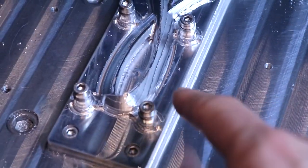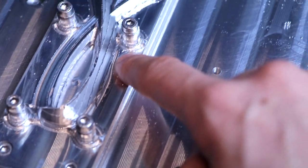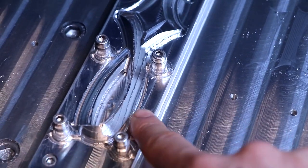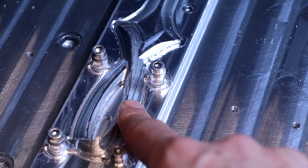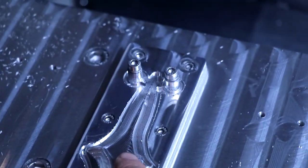The top side is more and more finished. I really think this tool is getting at an end. And also, it cut way deeper here than I thought it would. For the 6mm end mill, I added a block to a certain height, but for this one, I didn't, because I needed to do the pocket in the middle. So now I'm going to do the engraving.